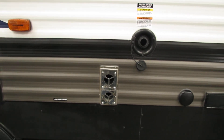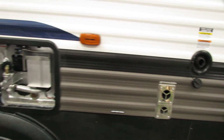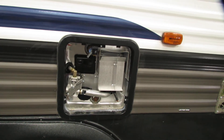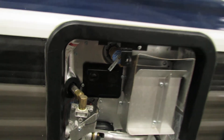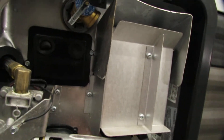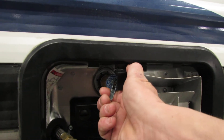I do recommend buying mud dauber screens to cover those furnace vents — that way insects can't get in there, it's a good investment. Here's your hot water heater. Basically to get this thing going, you're going to want to turn your propane on at the front, make sure that you completely fill it with water, put your plug in first obviously.